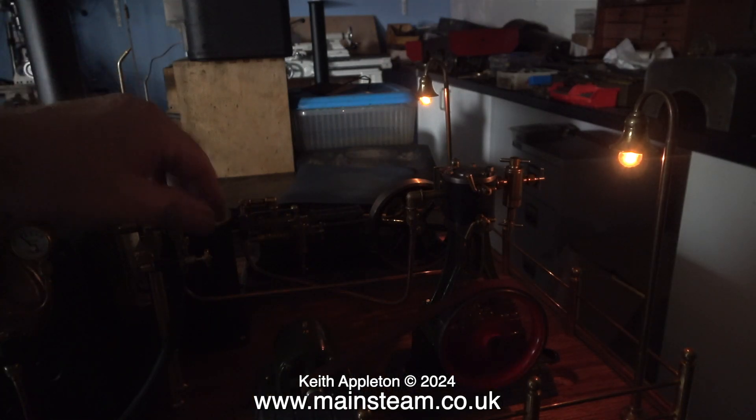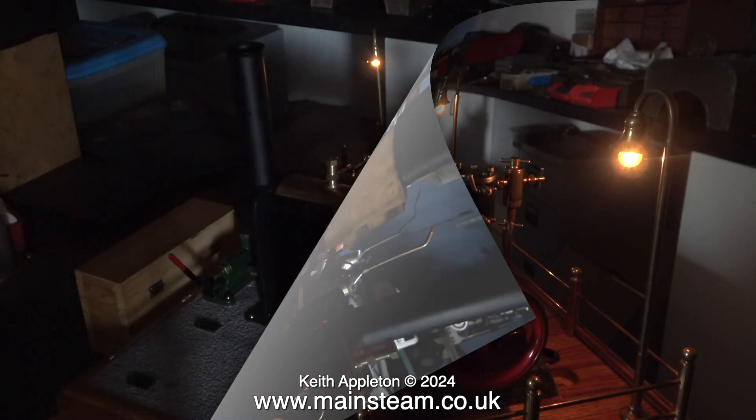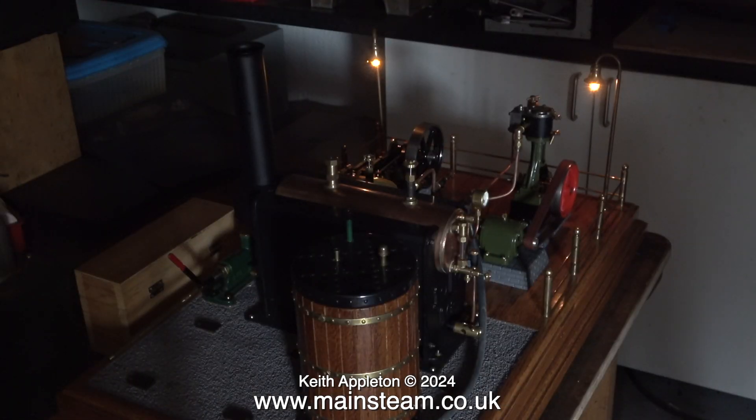The lights would not light at all in parallel, but in series they do — but they're not very bright. I'll turn out the light to illustrate this. Yes, they're quite dim. I wouldn't like to walk around a full-size engine house if the lights were as dim as these. I think these are probably three watt bulbs and they do put a load on the dynamo.